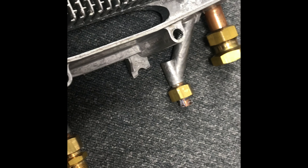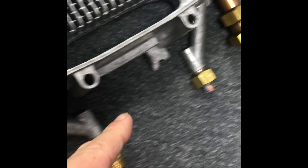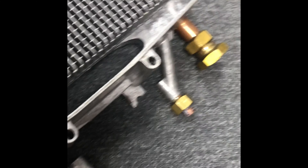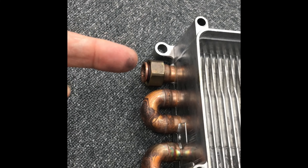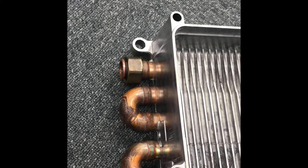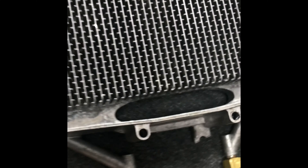This is a 2-in-1 heat exchanger — basically a copper pipe, 22mm for the heating and 15mm for the hot water. Because it's 2-in-1, it can be used in a combi system or multi-point. Always make sure you fit a descaler, as these are prone to blocking up. Silver solder joints. There's no automatic air vent — it's a manual one. If it does block up, you can use a power flusher with descaler. It's a silicone-alumina coated heat exchanger.